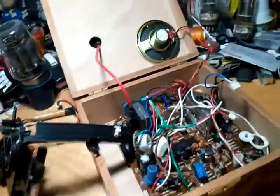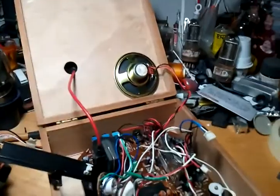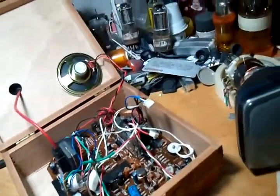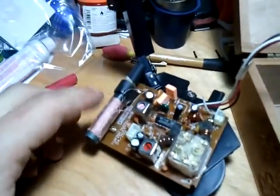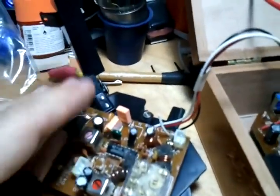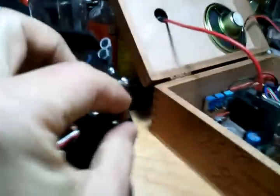I don't know where I put the TV — oh, here it is. You've got all your stations up here, and that's where this little white dial would go back and forth and tell you, as you're tuning it, what you're watching or listening to. I'm going to ditch all that, because who really cares about the radio function on a mini-Predicta, which I think is just a pretty neat concept in itself. I looked all around and couldn't find anybody else who did this. I've got to trim this down — I don't think much of this board is necessary. I know this is AM or FM — or just strictly AM, I'm not sure — antenna. I'll strip that down and just have the tuner knob here, probably go to something a little bit smaller if possible.